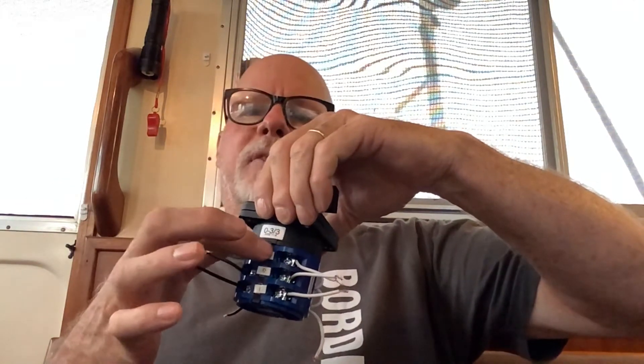When I was trying to figure it out, there was no way I could on my own, so I had a master electrician do this. This is the top of the switch right here. This connection goes to the panel, and you have to link all of these together. Same thing down here for your neutral and for your hot. Then on this side over here you pick your source — your neutral and your hot. This is completely different. This right here is our load side, and this right here is our neutral side.